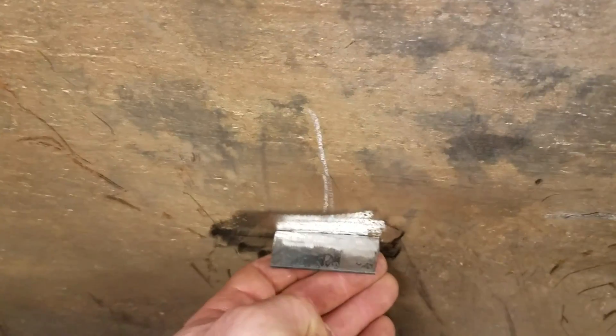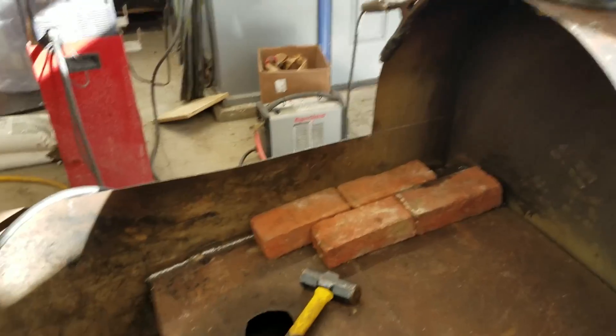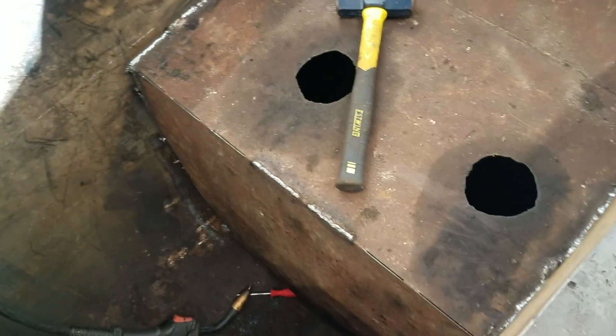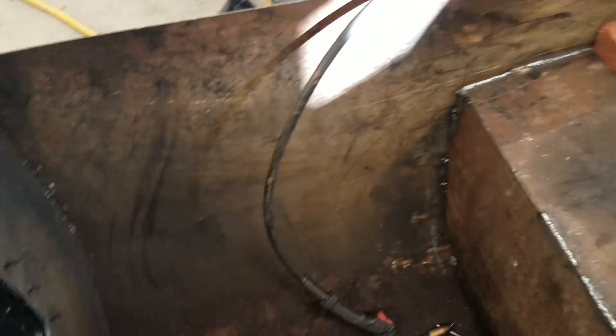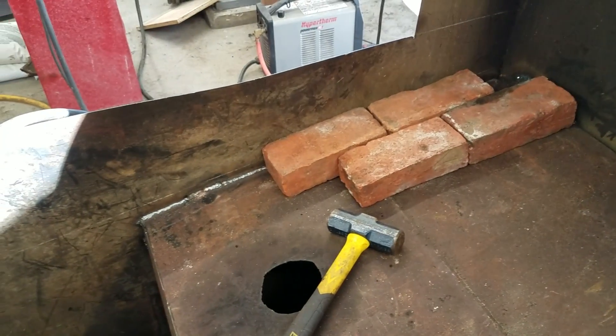I'm going to weld the brackets at a spot six inches down from the top of the table — one on each side. The spots up front are 24 inches ahead and nine inches down, so it'll be tapering three inches in two feet as it goes up towards the flue. That'll hold the steel bulkhead in place. Now I've got the brackets welded in, and the bulkhead is tacked into place. Right here will be the firebox; over here it's going to have an angle so the flue gases travel up and are forced towards the pan the further from the fire they get as they go out the flue.